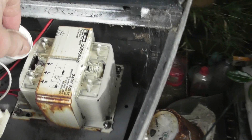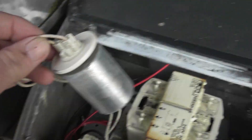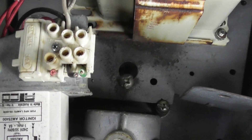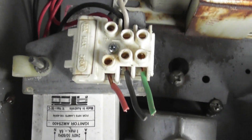Two is always better than one. I'll just open this up - looks really cool. The capacitor has decased itself. I don't know about the other part of the casing - this must have fallen out when the streetlight guys took it out. But here, that's the way they wire them up. Active on the fuse, neutral in the middle, and then earth there.